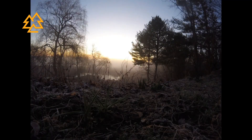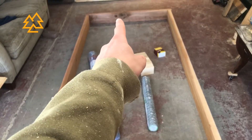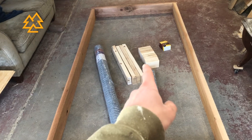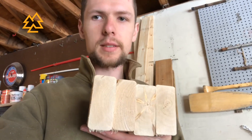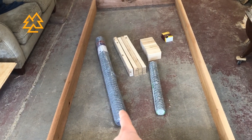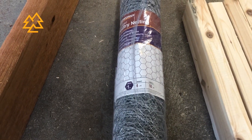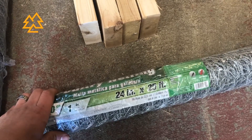I've got everything laid out that we're going to need. We've got two eight-foot two-by-sixes, and then one two-by-six cut into four-foot lengths. We need one two-by-four cut into four two-foot sections, and four six-inch two-by-four pieces. We'll also need two-and-a-half-inch cabinet screws and chicken poultry netting. I've got one-inch mesh, 50 feet long and four feet high, plus another roll that is two feet wide and 25 feet long — also one-inch mesh.